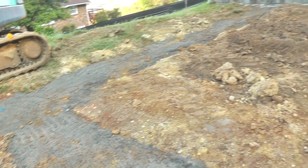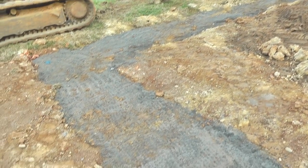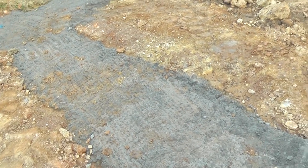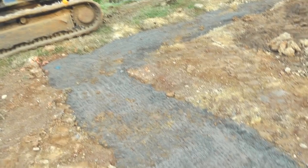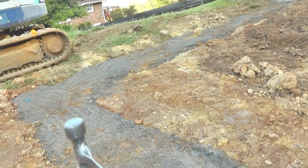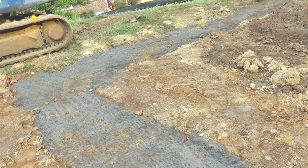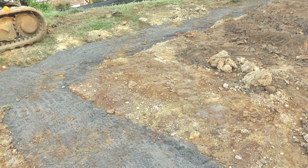But again, this is just designed to give yourself a base. It's probably 6 or 7 foot deep right here. So we took out all of the bad topsoil and field dirt, and used this to bring it back up. Now our real footing will go on top of this because we'll have a turned down slab out here, and it'll have two number fives in it.